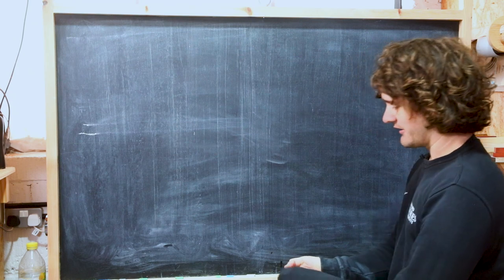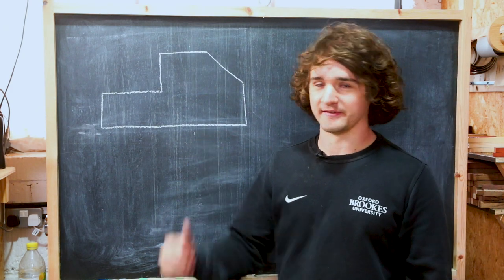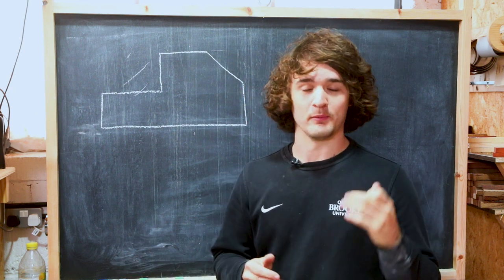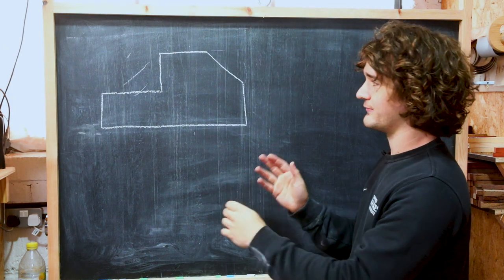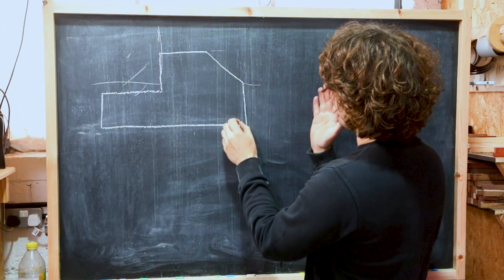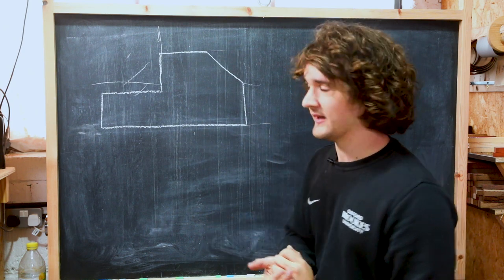If I draw a big version of the plinth — proportions are a little bit off but you get the idea. If you've got a router table it's very easy: a rebate cutter to get rid of that area, a chamfer cutter to get rid of that area, and then move on to the next video where we'll be cutting it to size, mitering the edges, and fitting it to the box. The only issue with creating this profile before gluing it up is that when clamping onto the base of the box, you've only got about eight millimeters of surface to push the clamps against — not a lot of gluing surface, but still enough to get the job done.